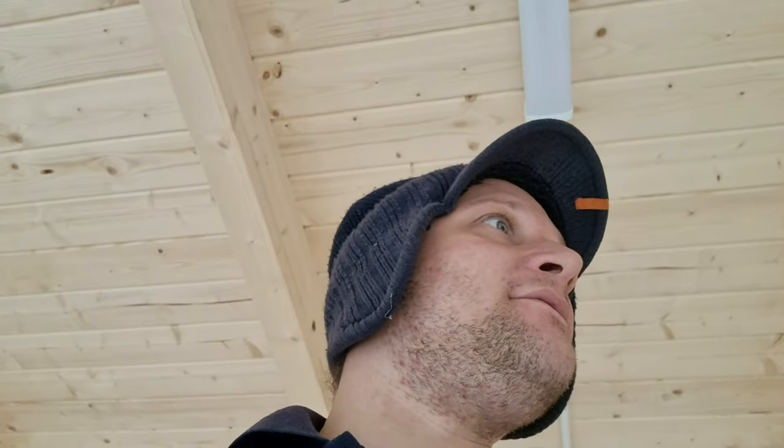I mean, I don't normally like using a light fitting as a junction point, because if that light fitting goes wrong, then you've got a source exactly the same, or you have to trim the conduit down or pull the cables out. It's really fiddly, but for this I think it's probably the best option. Otherwise, you're going to end up with conduits going everywhere, and it's one of those cabins where they want everything to be kind of concealed as much as possible.